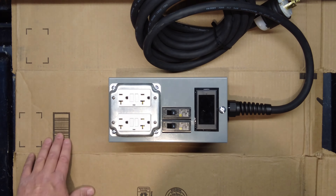The wire I used from the breaker to the outlets is 10 gauge, which is good for 30 amps — I could have used 12 gauge but had 10 on hand, so it's slightly oversized, which is fine. There are two wires going to the amp transformer for the amp reading on the gauge. I used a strain relief from Amazon, rubber feet on the bottom also from Amazon, and the electrical gauge — which gives you amps, watts, hertz and more — came from Amazon. Of course there are 20 amp GFI outlets as well.